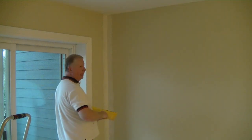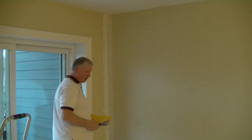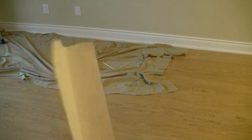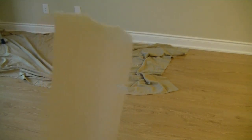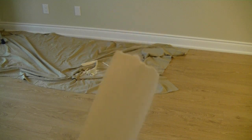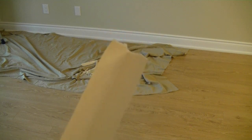The paper tape is the way to go. We don't like to use the fiber tape because it's really just a band-aid — it doesn't have the strength of the paper tape. It can actually cause problems. Especially if we try to do a full drywall job with the fiber tape, we run into issues such as cracks and separations in the wall between the sheets. So we want to use the paper tape where we can.